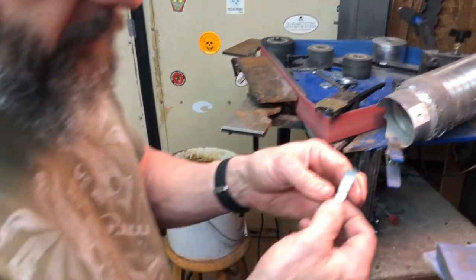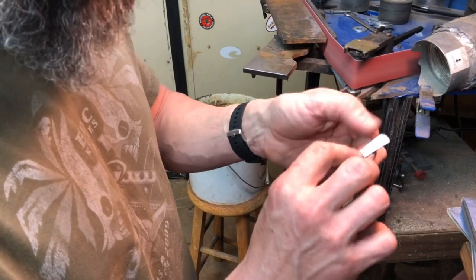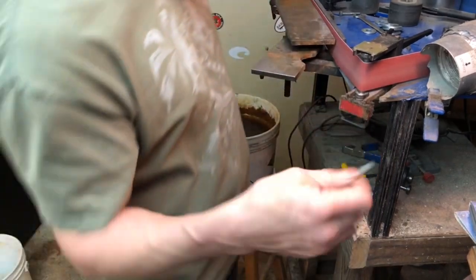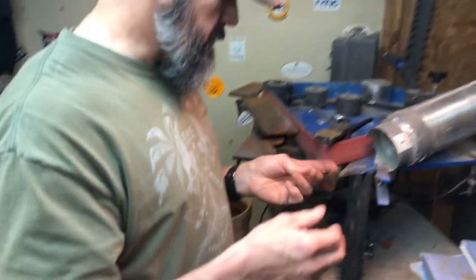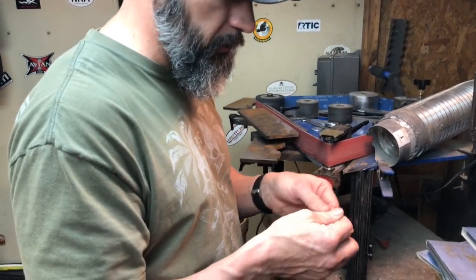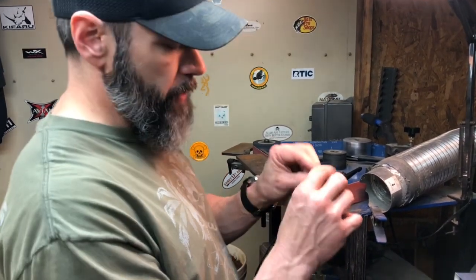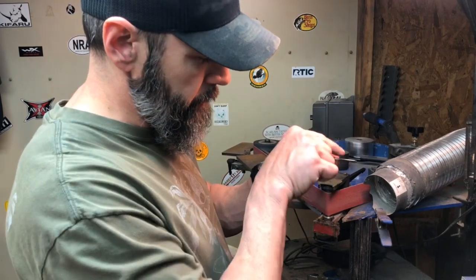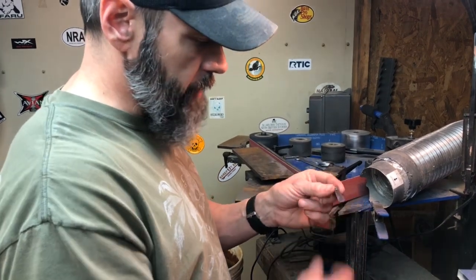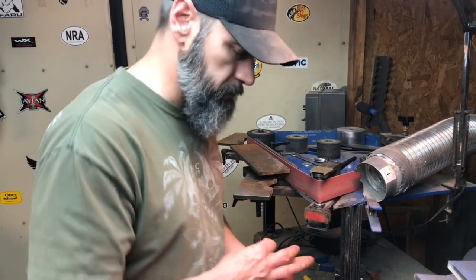As you can see, I've got just a little bit more right up in the top of the radius here that needs to clean up, but that's a pretty flat, smooth surface there. So I'm going to switch over and hit that with a 220 — that was an 80 — hit that with a 220 to kind of clean it up some. Even though it's the backside, we want it to still look good. Then I'll finish getting those last few little ripples out, and then it'll be ready to take a couple of bends — bent down, and then down here I'll get the bend back up and she'll be good to go. That's how I do that when I just do one at a time over here instead of on the mill.